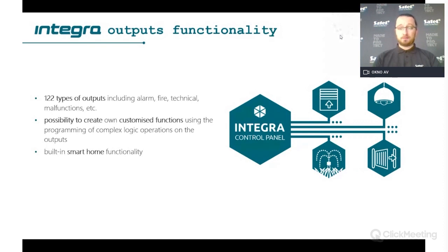Using logical AND and OR, you can combine many inputs into one output to control, for example, lights — using a timer, weather status, light levels outside, sprinkler status, and so on. You can combine all this information using logic to create quite advanced scenarios for controlling outputs. This can be used for sprinklers, lights, shutters, garage doors, and almost everything else.